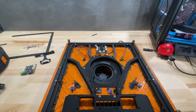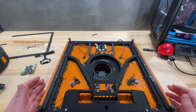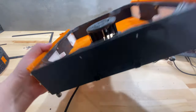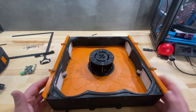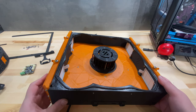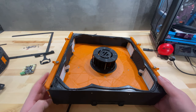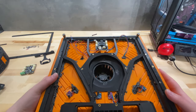You can see it's sealed with a lot of RTV silicone, and there's rubber foam seal on the chamber dividers as well. The point is to minimize air escaping these chambers. Every single chamber is sealed as well as I can. The side chambers are also sealed with RTV. For the top panel I used an O-ring, but for the side chambers I didn't, because those are opaque ABS rather than transparent acrylic, and it's a different O-ring size that I'd have to source separately.